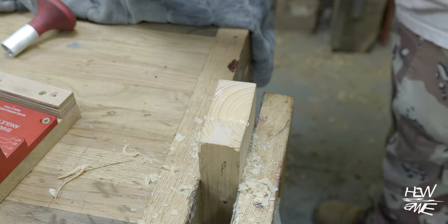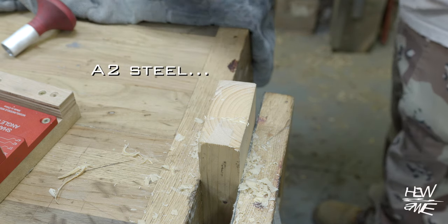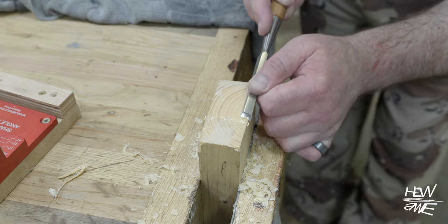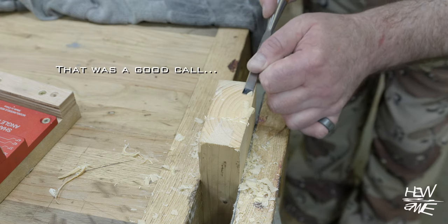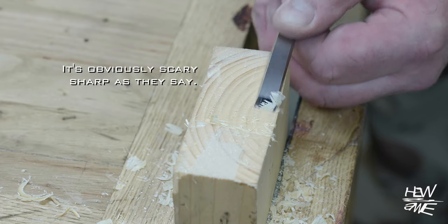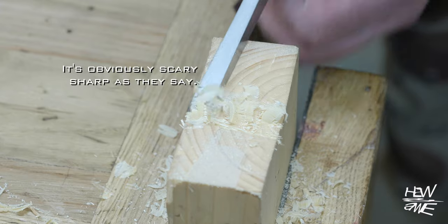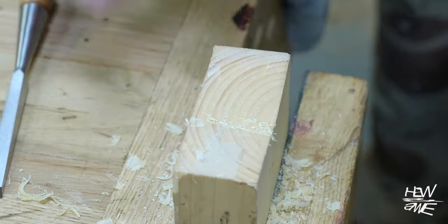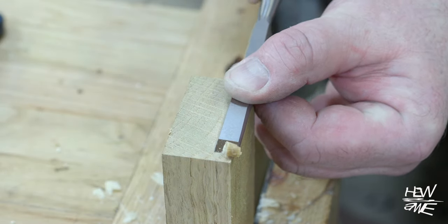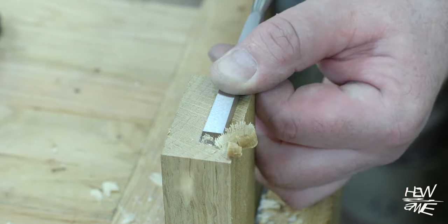Back to the stone, I think that was 15 vinegar strokes to sharp again. Just a couple more than you would if you're doing it freehand on the secondary bevel. On oak, cuts lovely too, so why bother with a secondary bevel? That's 30 minutes of my life I don't need to waste again and again and again every time that chisel becomes non-usable.